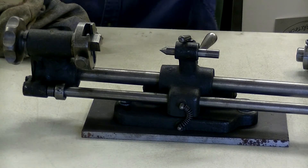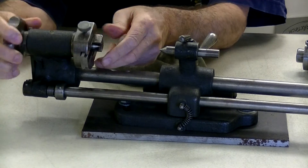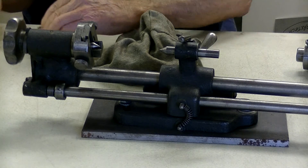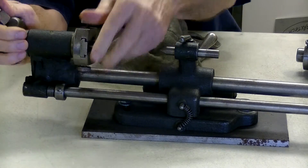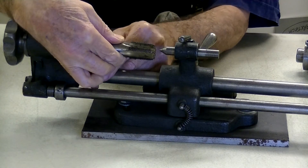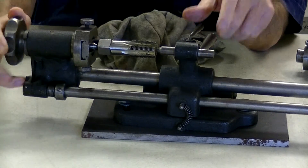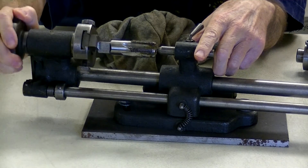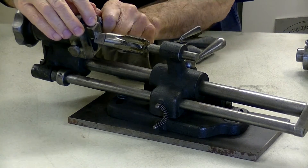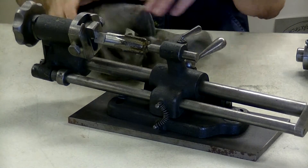Okay, we'll start off with the tap grinding attachment — very well made, bloody ancient. Here's a set of V-boxes on the back. There's a tap and a set position. Demonstration tap, nice and greasy. Under the set screw on the top, a V-jaw slides inside the housing and there's a centre that you put the tap up against. Push the centre in — the tap is now captured between centres. The V-jaw engages with the square of the tap, then you lock up the screw that says tap. So the tap is now captured between centres and set to the head.